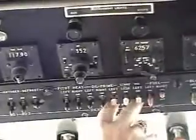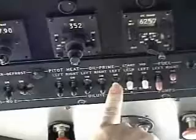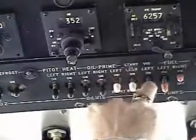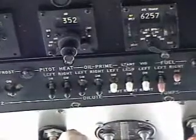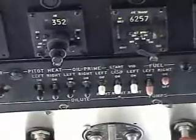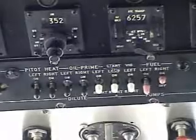There are three switches that we have to be concerned with. The first is the fuel primer. The second is the starter engage, and the third is the ignition vibrator, which supplies a high voltage to the spark plugs to aid the magneto in getting the spark plugs to have enough life to fire the cold engine.